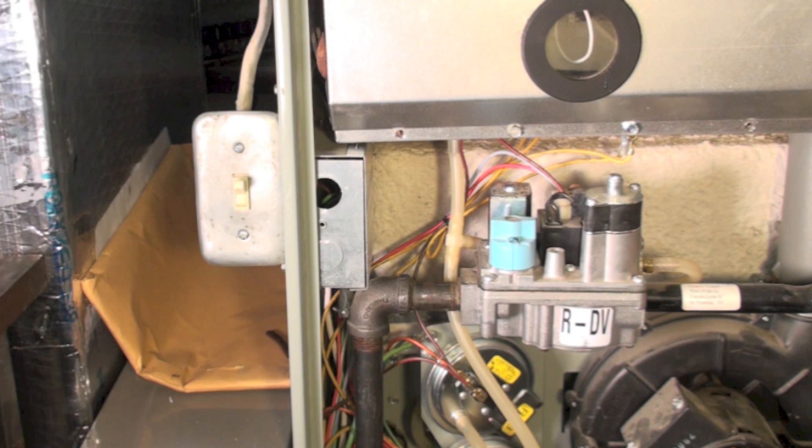The first thing you're going to have to do is turn the power off to the furnace. If you don't have an NCV non-contact voltage tester or meter, you can start the furnace so it's running and then kick the breaker off — whichever one shuts it down. I would also double check with an NCV anyway. Okay, that shut us down.